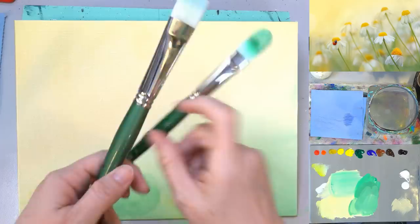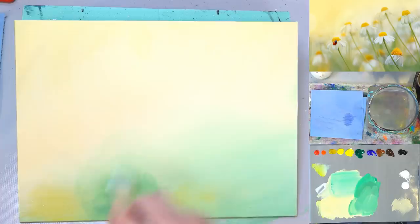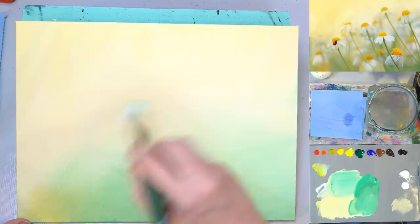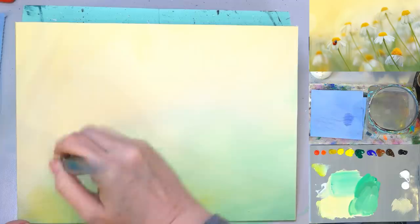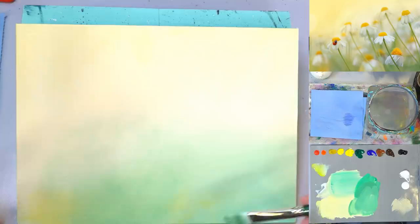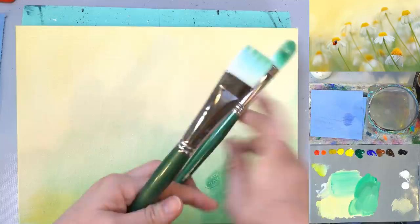I'm going to grab a little glazing liquid on a clean brush and kind of blend that color in, going back and forth. You could do this with water too instead of glazing liquid. Just kind of blend that in using the glazing liquid out here with a clean brush along those edges. See what it's doing right here — it's lifting — so that means the glazing liquid is already drying. I don't want to go over and over this too much. Move on to another spot; you can always go back and blend it in later. Don't keep blending the same area over and over because it will just start lifting off your color.